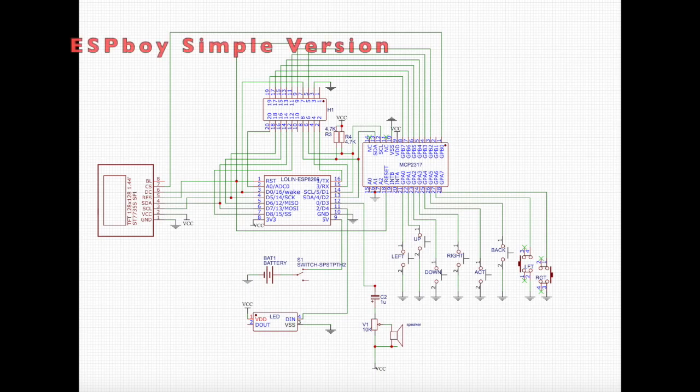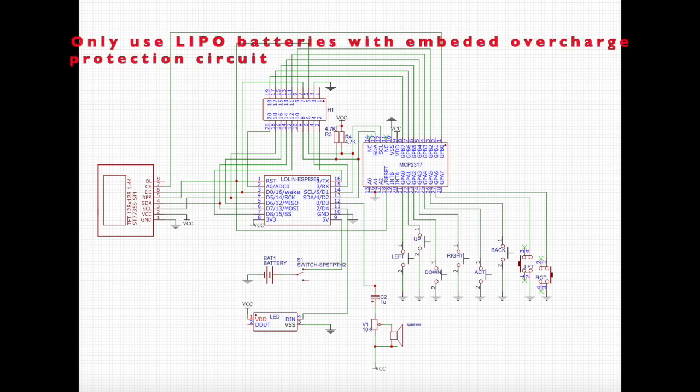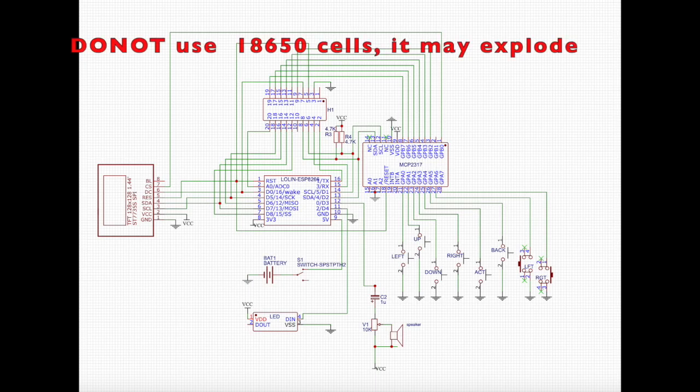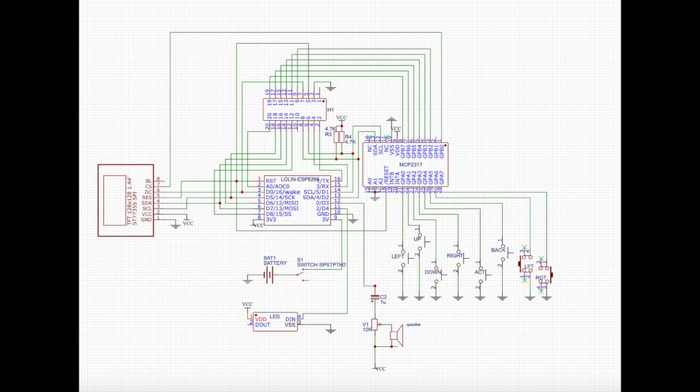This circuit diagram is similar to the one I showed for the breadboard version, only that I connect one more wire between the CS pin of the TFT display and port B0 of the MCP23017. This is to control the CS pin of the TFT. Please be careful — in this circuit we try to simplify things, so I did not use a separate charger board. We assume your LiPo battery will have a charging protection circuit, otherwise it will be very dangerous. Don't ever use standalone 18650 cells for this type of circuit. I'll put a link in the description so you can access the original image file of this circuit when you do the wiring.